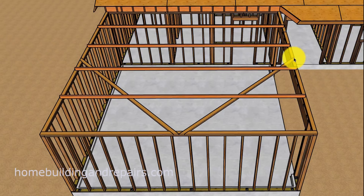You can see where, if this was to push out, then this here would want to push in also. Once the roof is framed for a gable roof and you have something like this, the rafter ties are going to usually prevent this from moving in either direction, which is going to stabilize this wall.